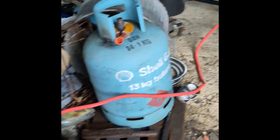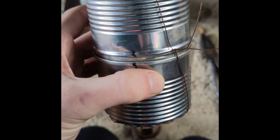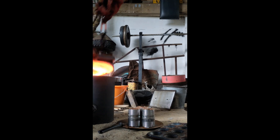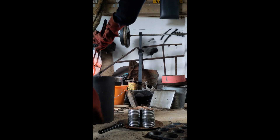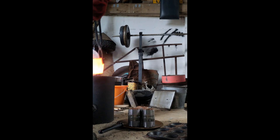Here's my setup. I have a gas forge which I'm melting down some scrap brass in. I used wire to stop the tops from rising up when you pour the metal in, because the seal isn't the tightest and the molten brass is quite heavy — it could push the entire top of the mould up, causing it to overflow. One of mine did overflow because my seal wasn't good enough.